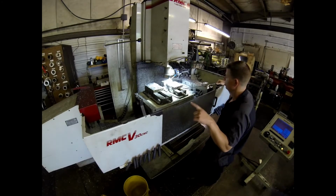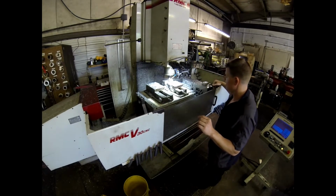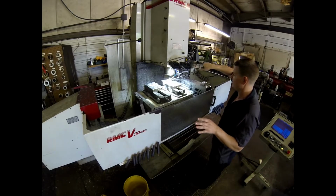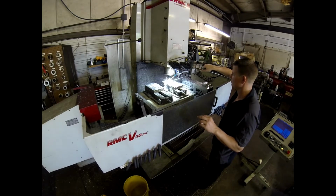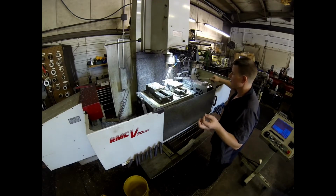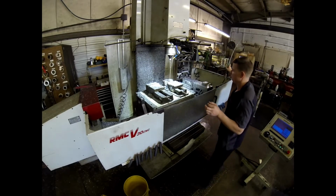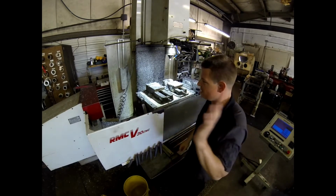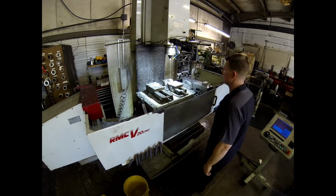Contour. I am cutting the bottom and the sides at the same time, which I know is a no-no, but 20 inches a minute. A little over 10,000 stock please. But it's the back side. It's where the cap goes. You'll never see it. So, fine. Tool number 0. Okay?